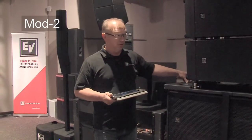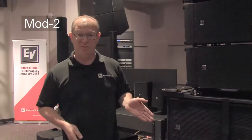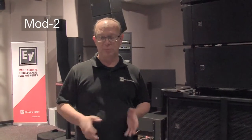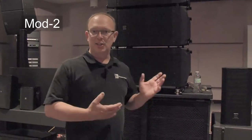The 12-inch and the 18-inch sub are currently available in their 70-volt version with transformers. This myth that you can't have low frequency when using transformers on a 70-volt system is truly that — it's a myth. We are clearly doing it here. That's an 18-inch subwoofer that we can run to high level at a distance at 70 volt.